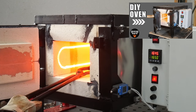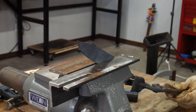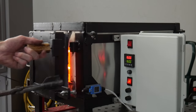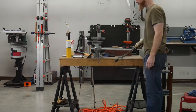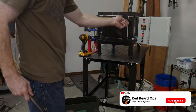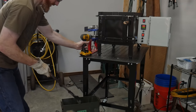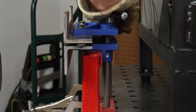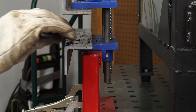I set up my homemade heat-treating oven on the welding table — and embarrassingly, this is the first time I'm actually using it to heat treat a knife since building it in my old shop. I did some normalization cycles; I wasn't sure if this was 1084 or 1095 steel, so I decided to treat it as 1095, working down from around 1650°F in normalizing cycles. One thing I did not do that I will in the future is an annealing cycle after normalization at around 1400°F before the quench. I'll do a few normalizing cycles, an annealing cycle, then bring it to quenching temperature.